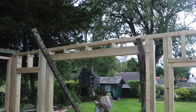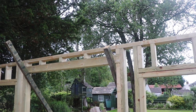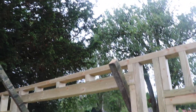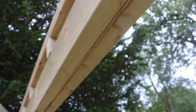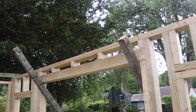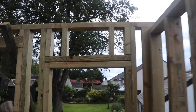The other error: I've got a 1500mm wide doorway and I used 4x2 CLS treated timber — 100x50 — for the door header, whereas 2x6 timbers are recommended for door opening headers. I've spliced in some 5mm plywood just to bring the timber out to the right alignment with the rest of the stud work, and I hope it's going to be strong enough for the 1500mm wide door. Also, in my rush to get completed, I've put this header in the wrong way around — it should be turned through 90 degrees. I'm just hoping that's going to be okay.